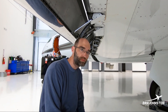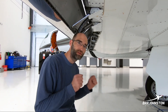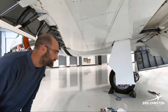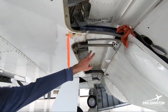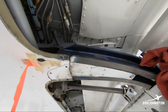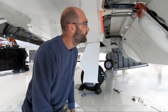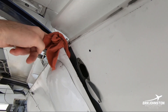Are the aileron controls boosted by hydraulics? They're purely hydraulic. It flies light on the controls — you've got hydraulic feedback to the yoke and to the pedals. While we're under here, the flaps are down. We've got to clean and re-grease the jack screws and the ball joints inside, as well as the rollers. They made it a nightmare to grease because you have to go up through here to reach the grease fitting way back in there.